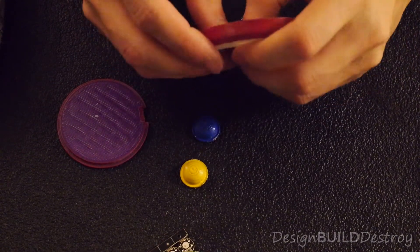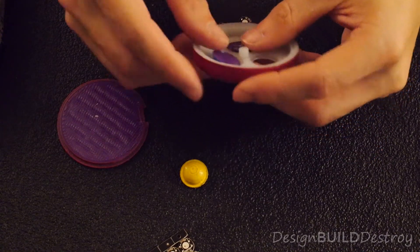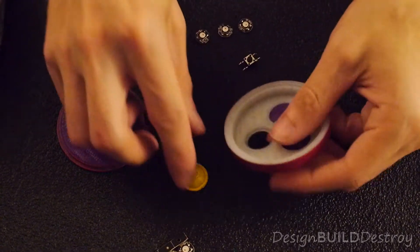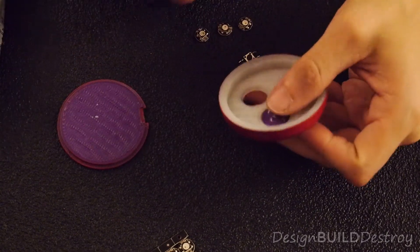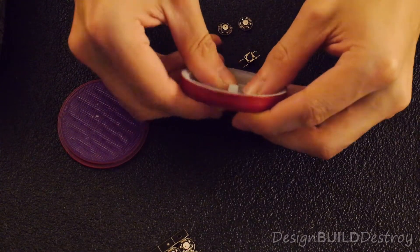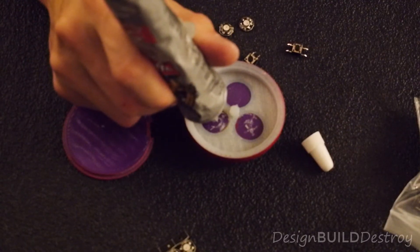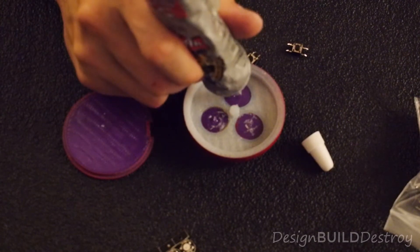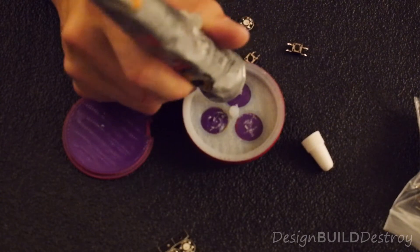The front pack was designed to be a very specific height with recesses for the buttons, allowing me to print half-sphere button tops with a flat lip that can be glued directly to the top of small momentary push buttons. When assembled, the button tops can't shift around or fall out of position, but they use the mechanics of the push button below for springiness, giving the printed button top a nice clicky feel without having to go crazy.